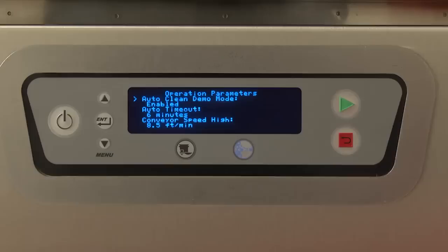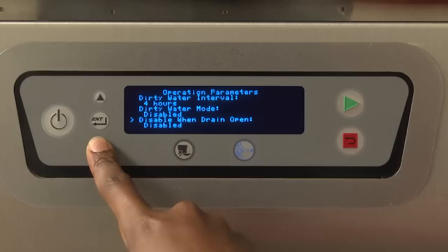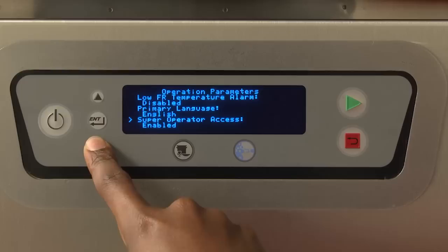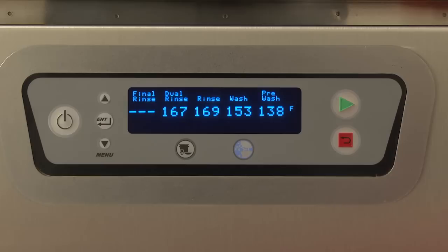The dishwasher is equipped with electronic digital controls to allow greater precision for cleaning ware, maintaining required tank temperatures, and other advanced functions. Some of these functions are customizable to suit the needs of your kitchen operation. All customization is performed through the on-screen menu using the up, down, menu, enter, and stop/back keys located on the keypad on the control box.